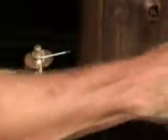As the Cortool is cranked, the knot tightens and the fence is erected. Undoubtedly, this is the strongest known wire knot. When one is satisfied with the tension, one can fasten the other end of the binding piece. The so-called binding leg is then wound twice around the pole and cut off from the coil.